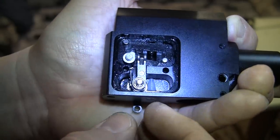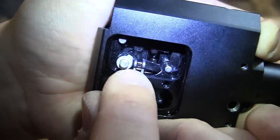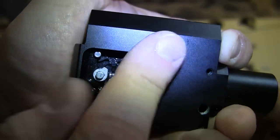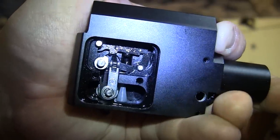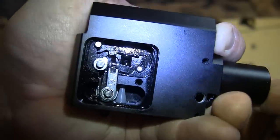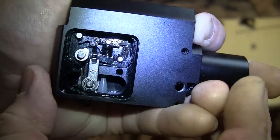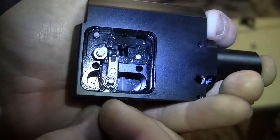This small part on top is under a flat spring. This is what allows the trigger to catch back in the front position after you fire, so it works in semi-auto not full-auto. This is the mechanism that catches the valve closed even while you still have the trigger pressed — similar to every semi-auto air gun or firearm.